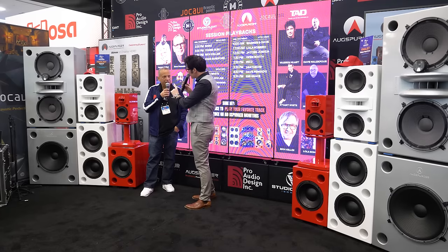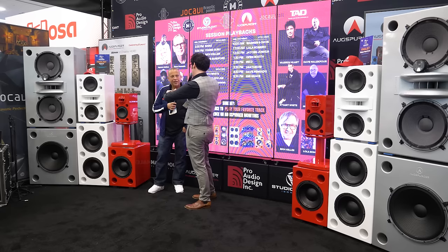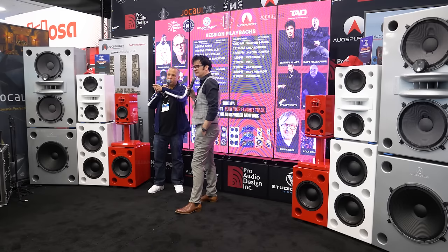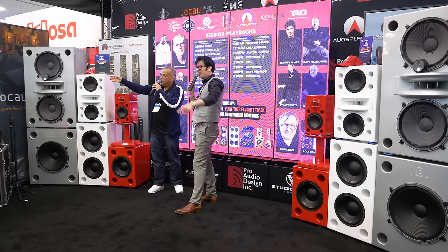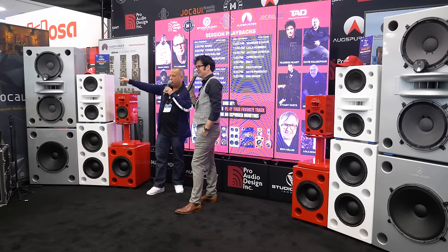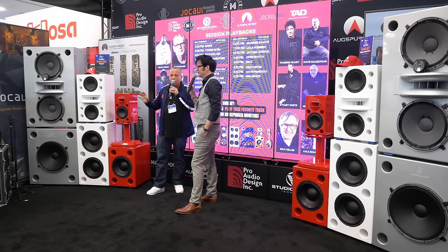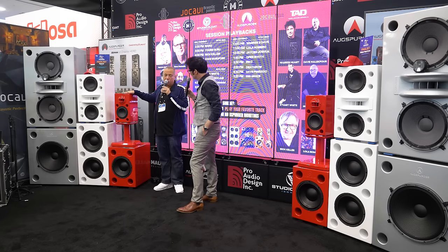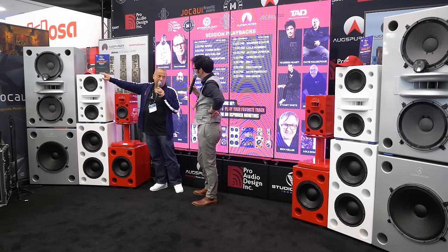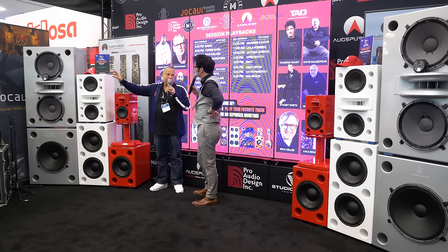It sounds phenomenal. It's interesting with that track, and it would be a good one for you because it translates really well across all three speakers. Well, and of course, when you got to the big speaker, this young woman in the middle, she's actually in the sweet spot. I kept thinking, should I get up and walk around? Well, it is definitely a spot to hear the big speakers, that row, because the distance of them apart also relates to where the low frequency and the high frequency all come together perfectly. This speaker, by the way, you can sit 1 foot from it and it will come together as one thing. This speaker, it's about 3 feet. That speaker is really like 2 meters before it even does anything.